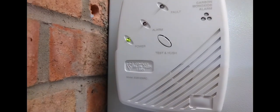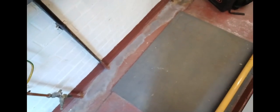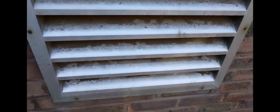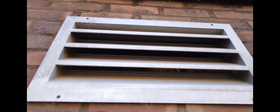Not sure if you guys wear your CO alarm belts in the plant room — it's good to do so. It looks like a Spirotech filter. Our safety mat is in place here. This is the flue — the room-sealed flue discharge. And then here you have the ventilation, low and then high.